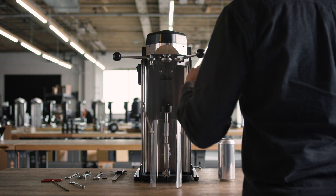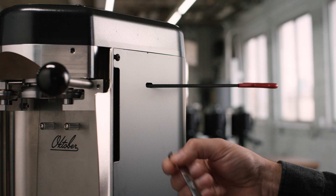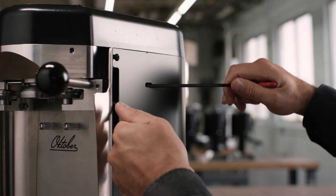To decrease the seam thickness, loosen the nut and turn the screw counterclockwise. If the seam is too small, turn the screw clockwise. A full turn of the screw adjusts the thickness about 0.001 inches.